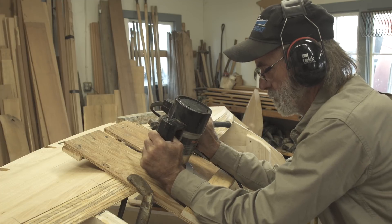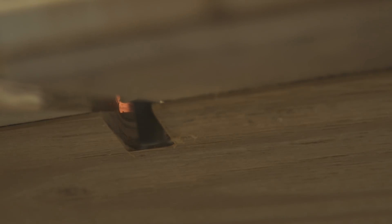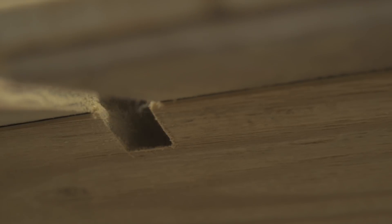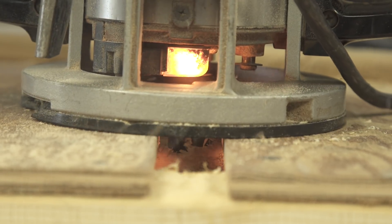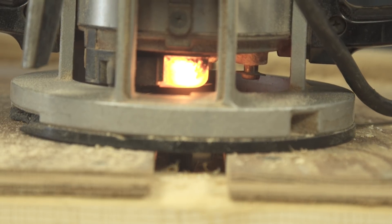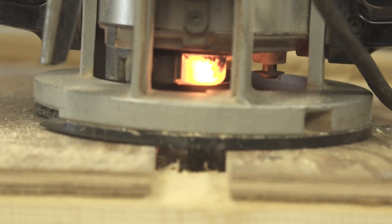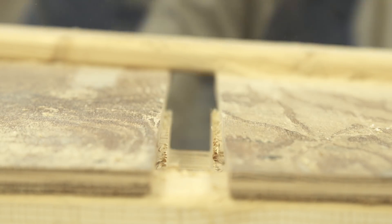Be patient when making a cut like this with a router — there's only a little bit of cutting in front of you and going like a madman won't help. Go along nice and patient, go up one side a little bit, draw back, go up the other side — you're cutting both sides and all that material ejects really nicely. Don't plunge the bit in too deeply because you'll start re-cutting dust you've already cut and create too much heat. Especially with cedar, which is oily — cut it too fast and you'll get a lot of smoke. Break out nice and slow at the finish so you don't chip it out, then go up and down both sides one more time to make sure there are no lumps in the cut.